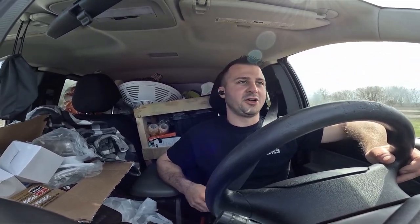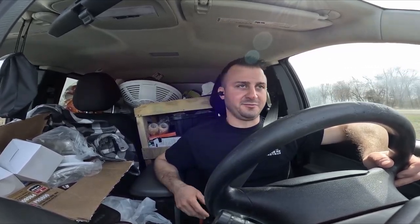Usually when you have storms, it puts the power out, and then you have the battery backup, which is awesome. If the place isn't known for the power going out, I'm not going to worry about it. And those battery backups, I swear, there's something always going wrong with them, because you have so many moving parts. Like, you have the battery that's going bad. If you don't get the maintenance-free battery, you have to add water to the battery, or the battery backup sump pump can be bad. And those pumps only last, I think, like 3 to 5 hours or something. Let me know if I'm wrong in the comments.